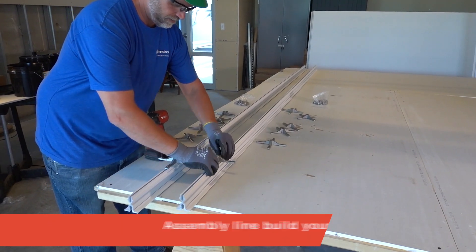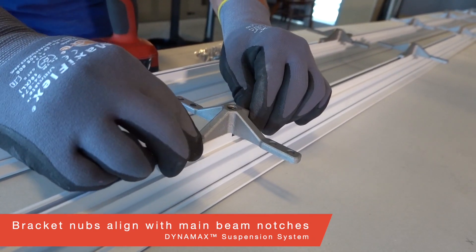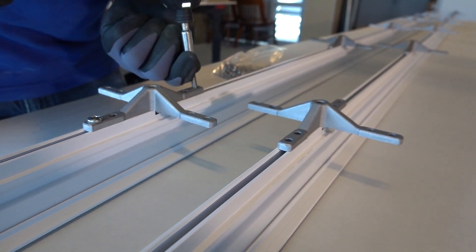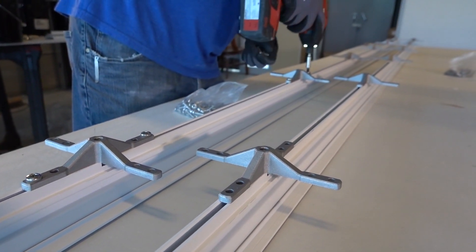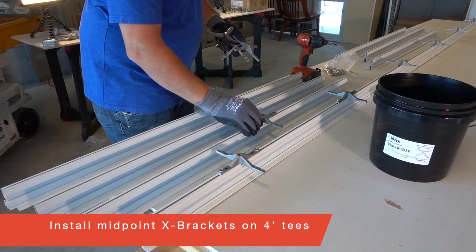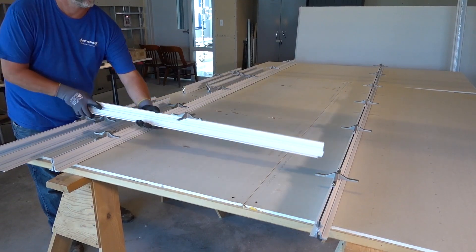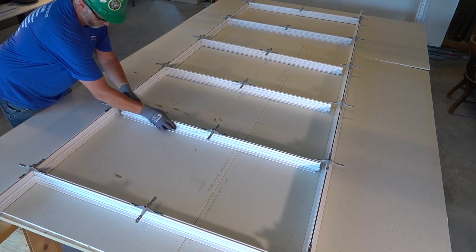Let's walk through the building of a 4 by 12 ladder. Your X braces have four nubs underneath that perfectly align with notches in the top of your Dynamax grid. These notches eliminate measuring and simplify the ladder building process. The nubs and notches securely hold your bracket in place while screwing them — just put two screws in per X bracket. Now let's space our mains four feet apart and prep the four foot cross T's with X brackets in the middle, assuming this is ultimately a 2 by 2 finished installation. Four foot Dynamax T's will create the rungs of the ladder. Attach brackets to the T's with screws, just like you did the main runner.